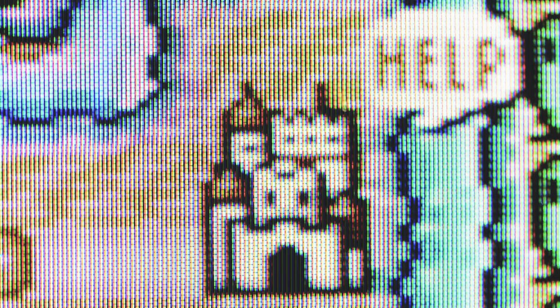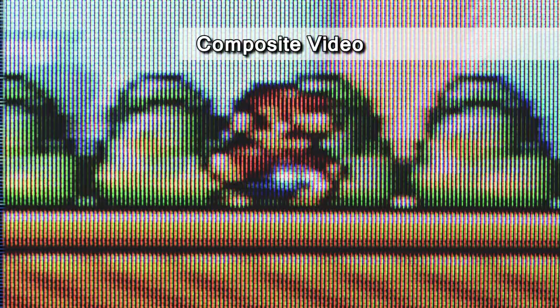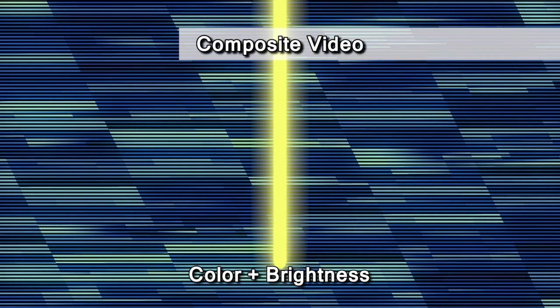Video sync isn't something you're likely to hear about outside of the world of RGB signals, but it's actually present in all forms of video. You ever seen an image like this? It's because something is throwing the sync signal out of whack. Sync is a series of continuous pulses that determines frame rate, horizontal width, how many lines are in the image, and where each pixel goes along the way. Composite video, usually represented by the familiar yellow RCA connector, combines color and brightness into a single cable, but it would just appear an incoherent mess without an additional signal telling your TV where all the pieces of the picture are supposed to appear.